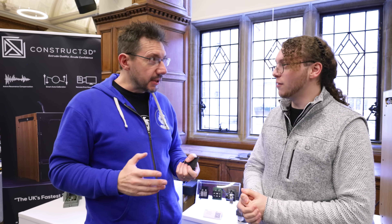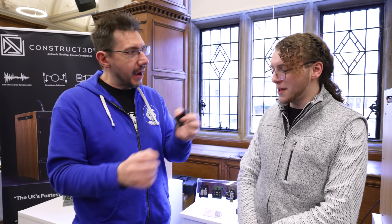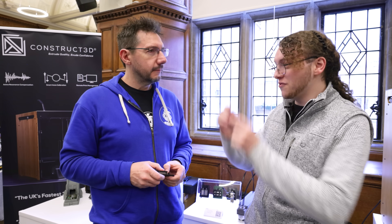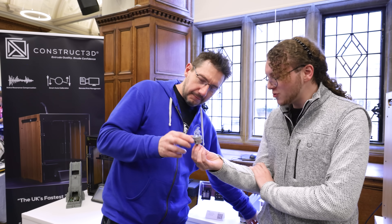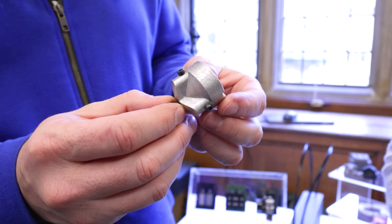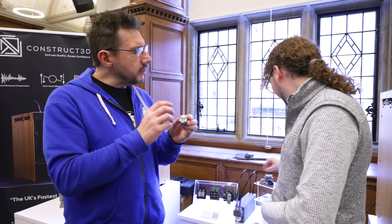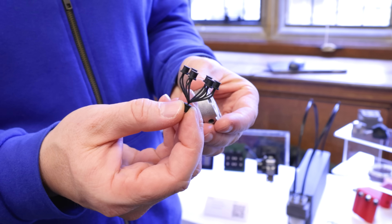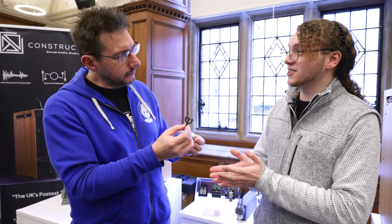You're talking about heating this length does things differently than heating this length broken up into smaller bits — you get much less oozing. Much less. When we talk about a super volcano with a 0.8 or 1.0 nozzle, you have this thick bead of toothpaste that just oozes out. And the other issue is it bends, because super volcanoes are long — that's a fulcrum — and you've got a tiny little heat break at the top that's going to snap off. Is there a visual explanation of it? That is metal 3D printed. It replaces the heat block entirely — it becomes the heat block. Then you put any regular nozzle in the tip of it. We're talking about the surface area within the melt zone of the nozzle itself, right? Split up that melt zone into multiple filament inputs. That block there has six inputs merging into one output, which is the nozzle that you're used to.